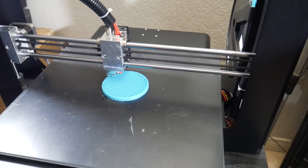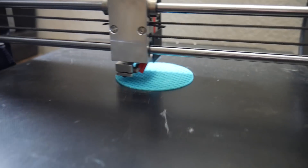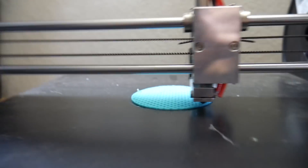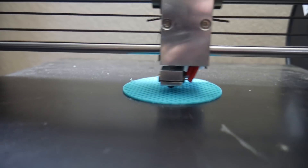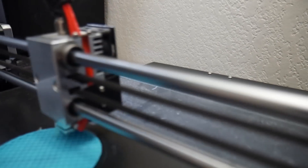The two tiny fans on the hot end, which are a little smaller than most fans, create a lot of noise especially when the machine is first turning on. I do plan on replacing the stepper drivers with silent ones and swapping the fans for quieter ones, but out of the box they are definitely noisy. This isn't the biggest deal, but when your print lab is in your bedroom, a 50-hour print can turn into quite a few sleepless nights.